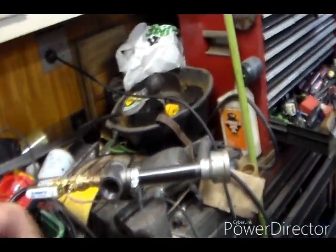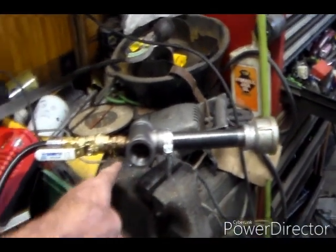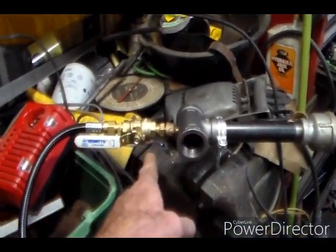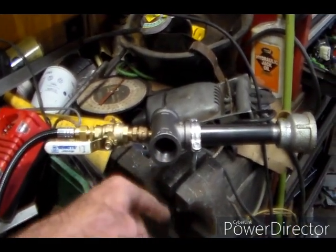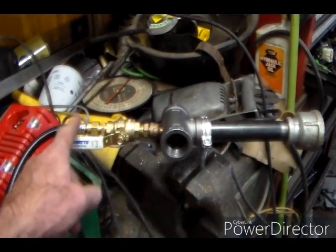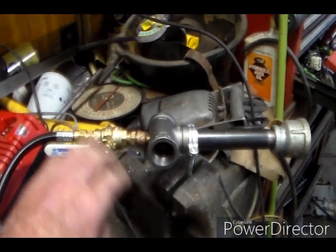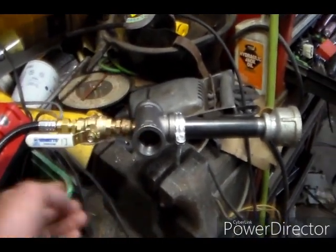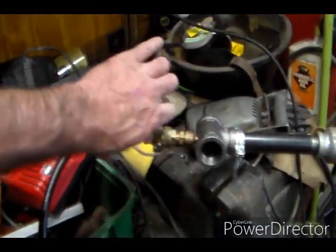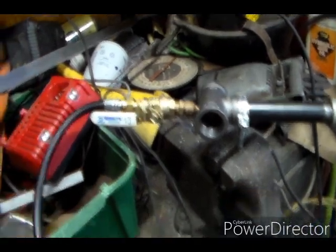But like I say, pretty simple. Big bell reducer, pipe nipple, T, some kind of 1/8" pipe to whatever, so that you can put a MIG welding tip in there, and then whatever you need to go from there to a quarter turn ball valve as an emergency shut off, because things get crazy, man. Just gases off, flame goes out. Then from there, whatever it takes to go down to your hose.